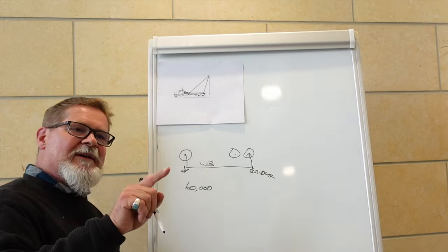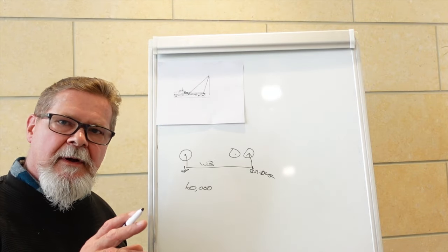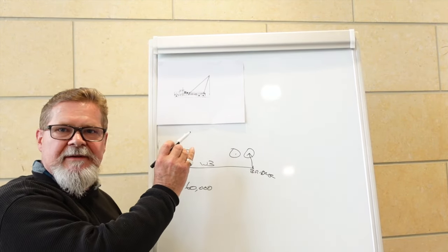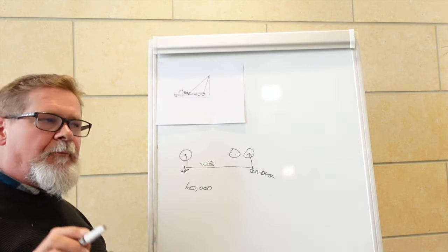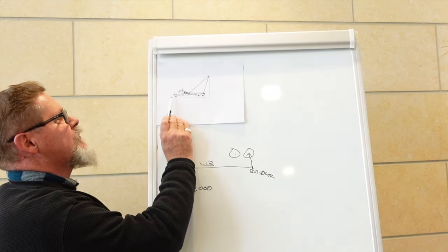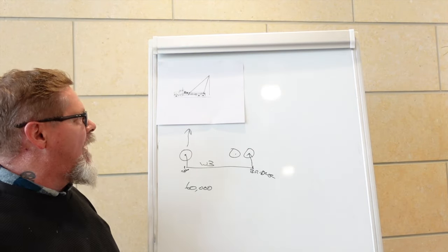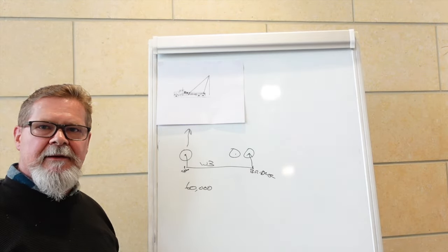There is a direct relationship between the weight of the truck and what it will pick up. And that picking capacity of the truck varies widely based on a number of other things, including the angle of hoist as these poles drop back like this, you can pick up less. And at some point, if you try to exceed the picking capacity of the truck, the counterweight effect will be the truck's wheels raising up in the air. Now, when I was running these trucks, I was known to purposely put the front of my truck 6 feet off the ground and show off and be loud and obnoxious. Anyway, let's try to stay on guitars here, shall we?